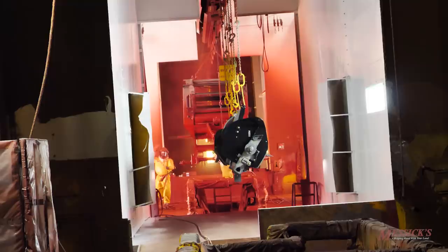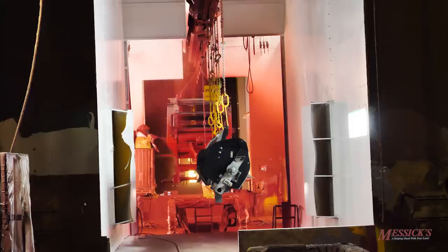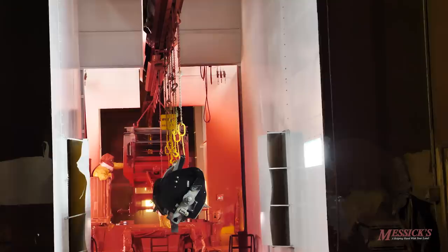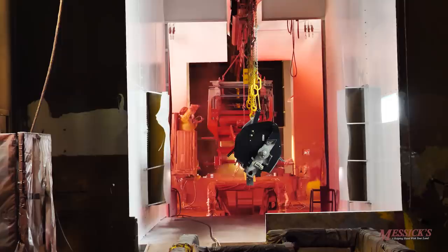Inside the powder system, powder is sprayed in three booths — yellow, CNH dark gray, and red — using robot bells. The powder is electrostatically charged, baked at 450 degrees to create a hardened coat. Components going through must be heat-tolerant at that temperature. Powder coating quality is better and robotic, but components like bearings that can't take the heat must go through the liquid system. Any powder that escapes is vacuumed up and recycled. The ovens and entire powder system run off landfill gas via a pipeline connecting to Route 23 that goes to Lancaster landfill.